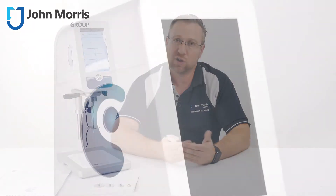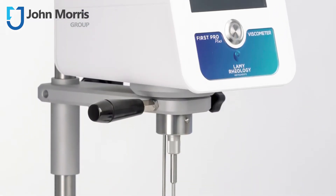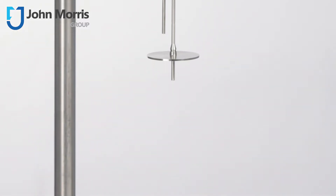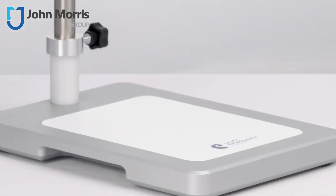The technology that LAMI uses in their viscometers is a servo motor with a digital encoder, which allows them to accurately measure the speed and therefore torque and viscosity of your sample. The springless nature of this design means LAMI viscometers are very robust with low maintenance costs and low downtime, and because you only need one unit you have a much smaller laboratory footprint.